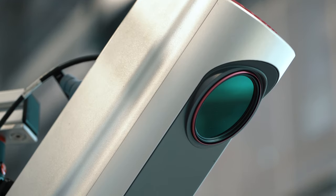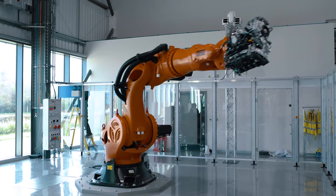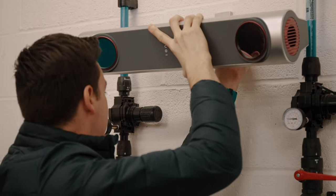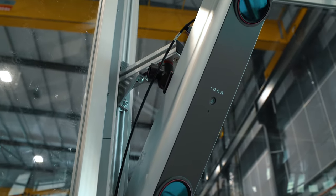The Iona system is robot agnostic — we can work with any robot, be that a KUKA, ABB, or FANUC. The things that change may be how we interact and pass data to the robot controller. With Iona we can reduce the commissioning time involved in first setting up a cell, provide a more consistent product quality, and ultimately ensure that the process consistently matches the designed intent.